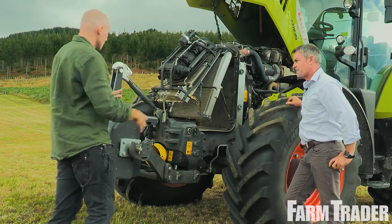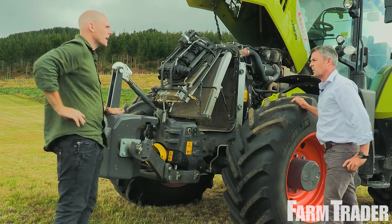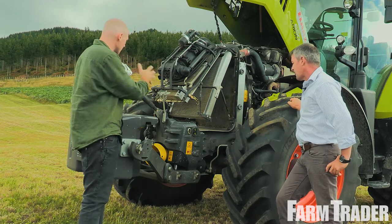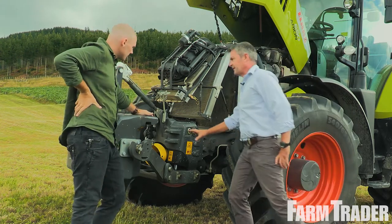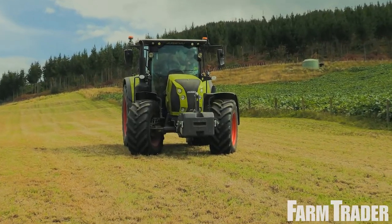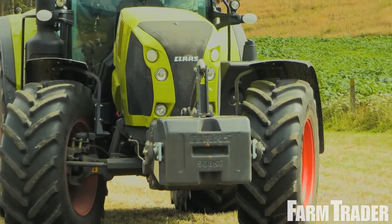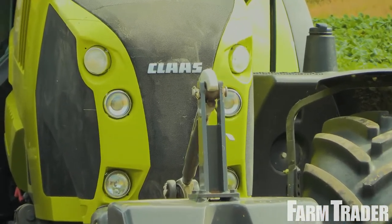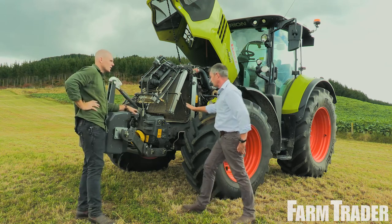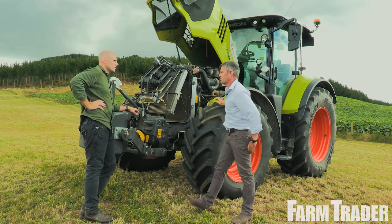So the 50-50 weight distribution — this one's obviously got front linkage. We've got the front ballast but there's obviously some other wheel weight options available for these. So just the front linkage here — it's a four ton front linkage, obviously with a PTO incorporated into it. We have external hydraulics for the front and a free flow return. We also have the ability now to lift and lower the linkage from remote buttons outside of the tractor, which makes it easier for hitching up. And there are factory front loader options with these. We take these tractors with what we call engine side rails, and we can actually bolt towers on now to fit a front end loader — nice and simple.